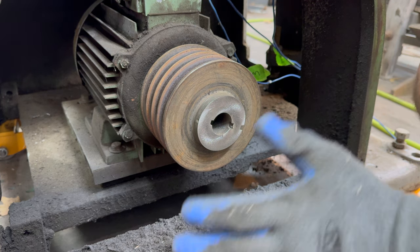A quick tip, a lot of old machine screws are slotted. And the best slotted screwdriver tips that you can find often come in gunsmithing screwdriver kits, which frankly are very affordable, and they do a great job of not marring or damaging the slots in these screws.